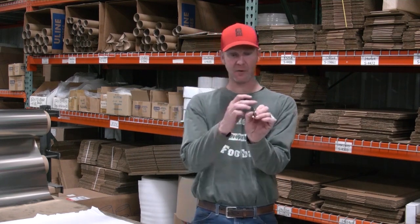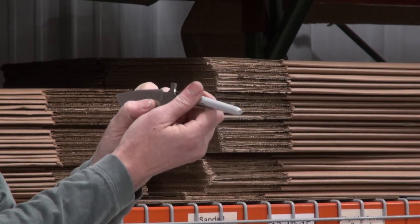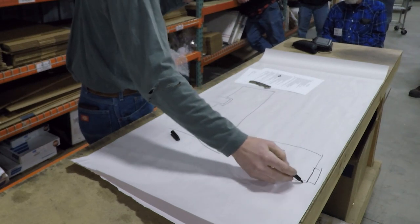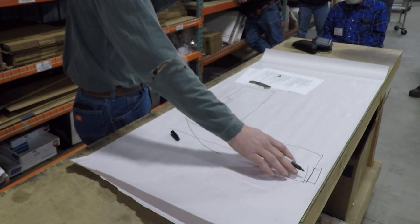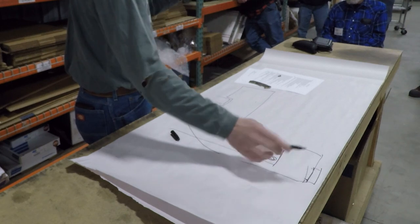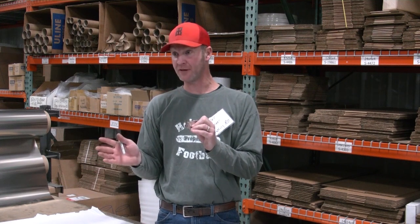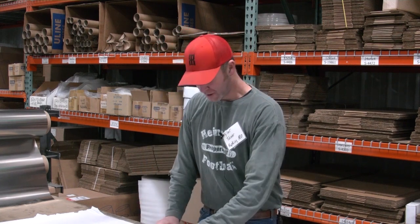Okay, as the knife's sitting here with the blade up, this would be the top of your lock face, the very top. This is where you want all the lock up. You do not want your lock bar engaging the whole entire face of this, because if you're fully engaging this all the time, you're probably going to be heavier on the bottom or top or so on. You're going to develop lock rock. It's going to stick more, and it's a pain in the butt to redo all that. So whenever you go to grind this,